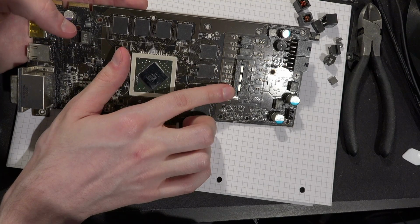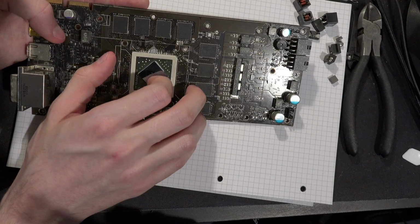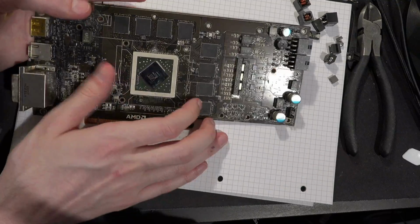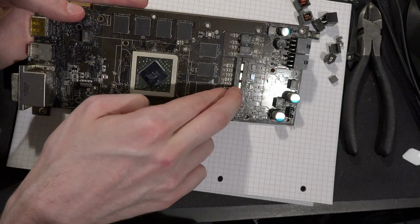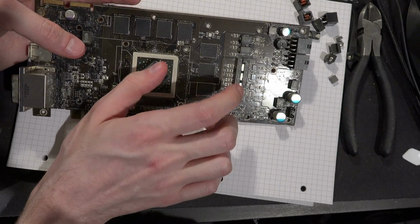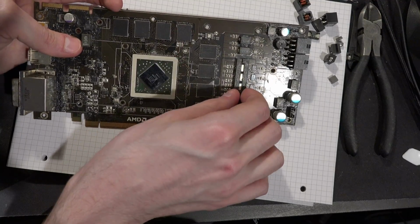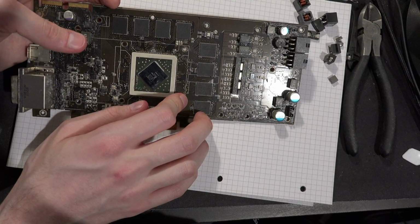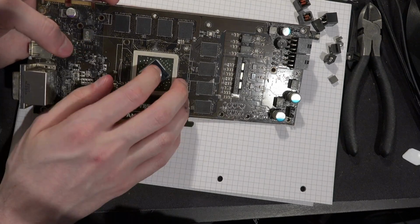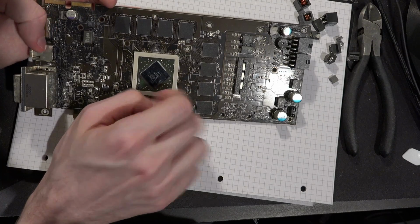That's a big inductor, and you have basically one big core for your 3 separate coils. So if you pull 40 amps and then go to 100 amps, or some kind of load change, that affects the entire thing, right? And that means you have this big slab of metal that can rattle around if it's loose. Now, it's not actually loose to the touch or anything, but my HD7970 uses this style of inductor for both of its V-Core VRMs. That is by far the whiniest card I own, probably because of this style of inductor construction. So yeah, that's not great.